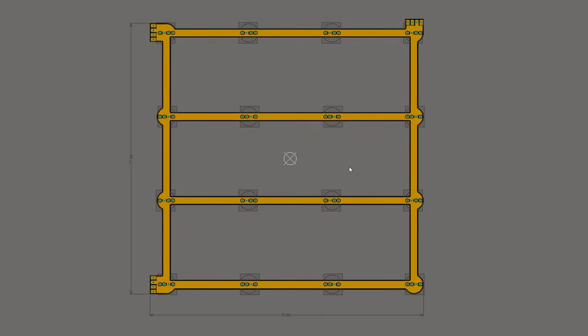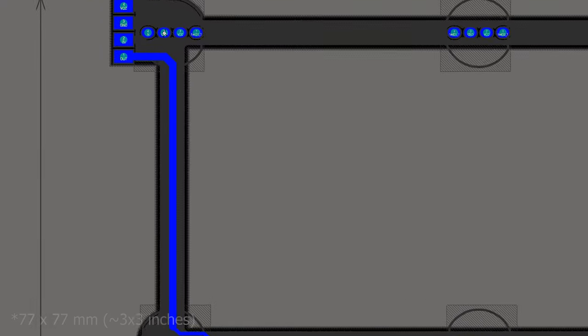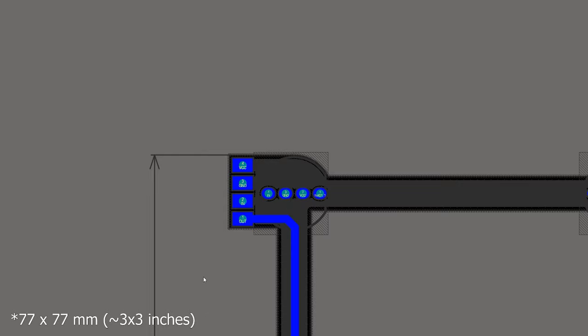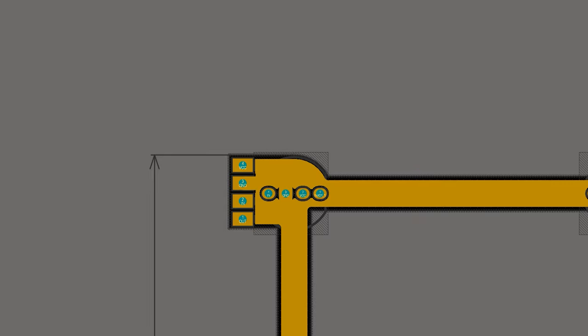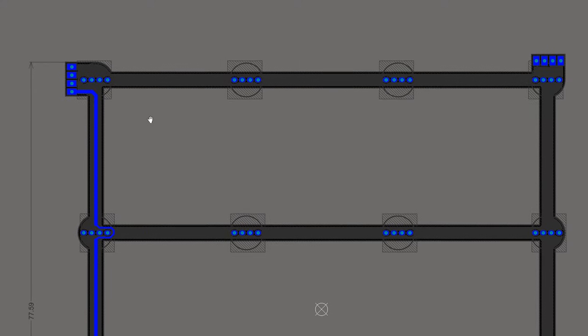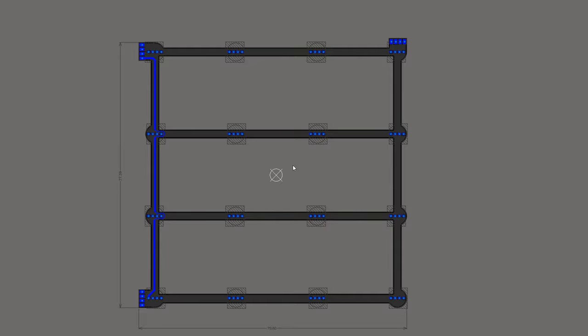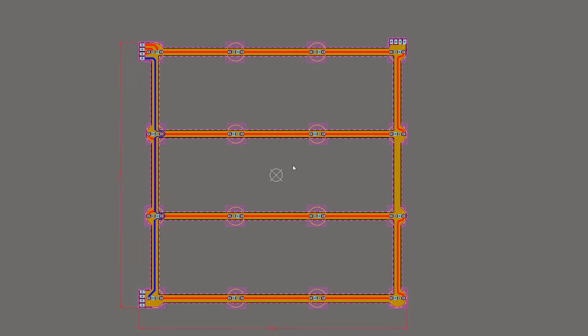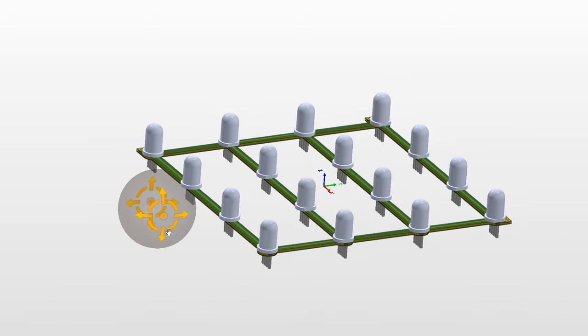I actually ended up designing a 4-layer PCB that I honestly think looks ridiculous, but you can leave a comment if you don't agree. The PCB outline is 100x100mm, but it basically has these 2mm wide arms and everything else is void. Every PCB shop that I asked for a quote emailed me to confirm that this is not a mistake. And if you look at the PCB design, literally every layer of this 4-layer board is dedicated to one leg of the WS2812 LED. Honestly, it's just so cool and odd to see at the same time.